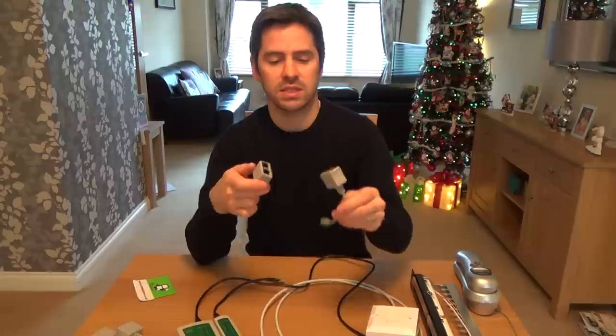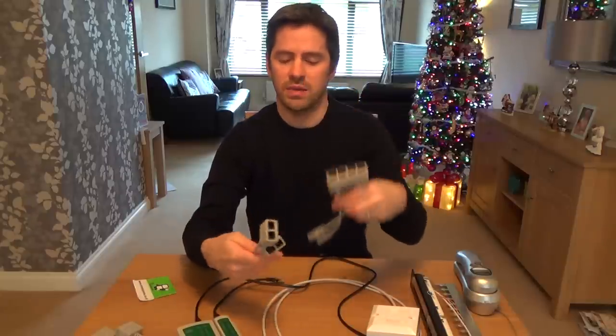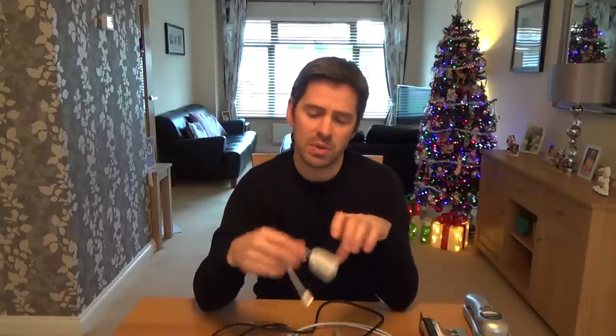Hopefully this has cleared things up — it can seem a little confusing but it's quite simple. All it's doing is utilizing the spare pairs in the cable that aren't used. To recap: grey is data/data, green is data/voice, and red is voice/voice. Have a look in my eBay shop at mrtelephone.co.uk where you'll find all of these for sale. If you liked the video, please give it a thumbs up and subscribe. I've got 30-plus videos on telephones and networking. I've explained it in a UK context using adapters, but it's the same principle worldwide — you just need your own converters.